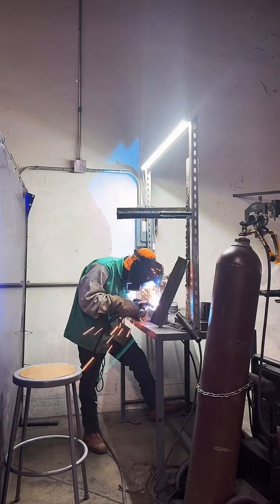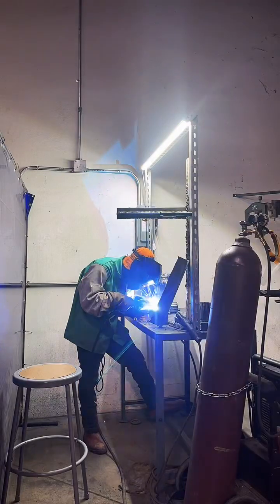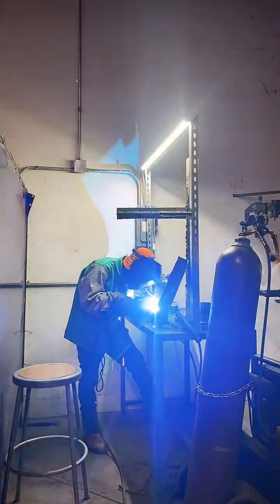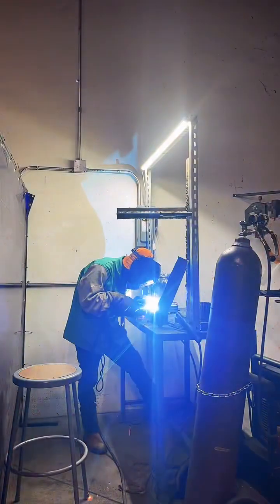And today, we are doing some fast track welding in Little Rock, Arkansas, off of Scott Hamilton Drive. Today, the welding student is working on MIG welding in three positions. He's actually doing a fillet weld flat, a fillet weld vertical down, and a fillet weld overhead. And then he's going back up to do two more fillets. So he's actually creating a three-pass fillet weld.